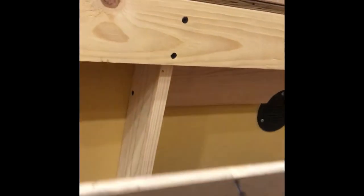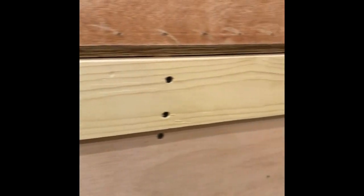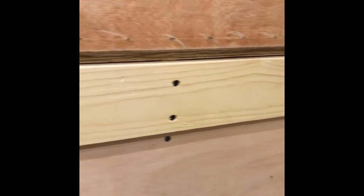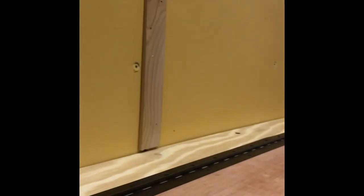This piece I put on top is primarily for looks — I just wanted to close it up and make it look a little nicer; I don't think it's needed structurally. That cover piece sits underneath this one-by-four which runs along the top, and this is the main support for the wall side of the bed. That's the back side of that piano hinge, and when the bed folds down it actually sits on top of that one-by-four — that's how the weight is transferred into the floor.